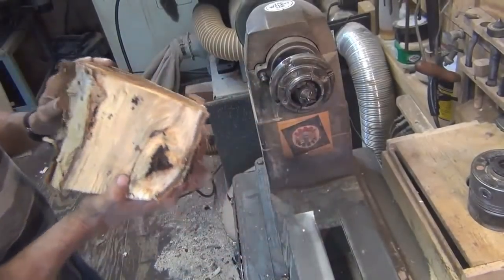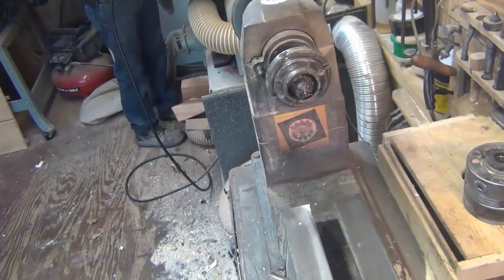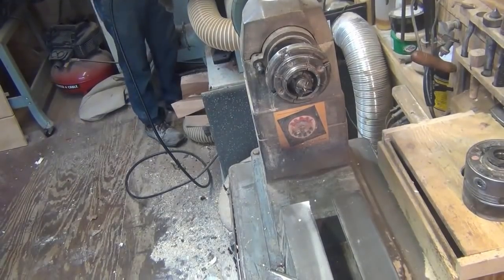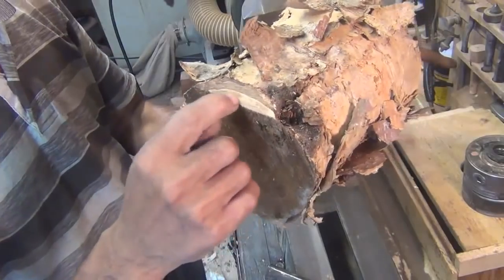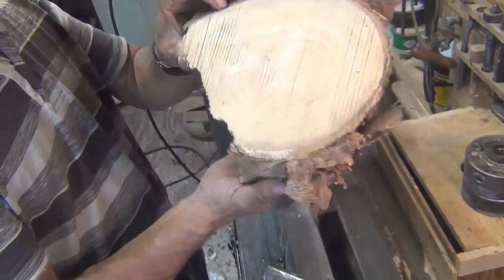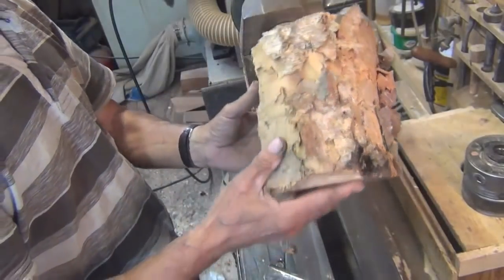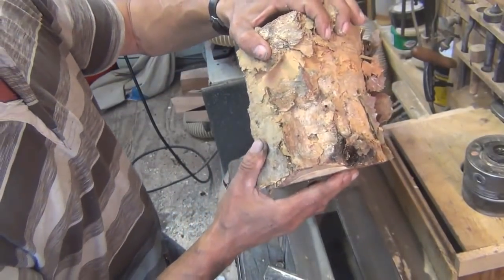So I'm going to make a couple of small preps. I'm going to make a small flat part on opposite ends. That's all I did. Just give it a little bit of a flat part so I'm not right on the edge of the piece. One there and one from my live center. And it really doesn't matter which one I set up over there first.